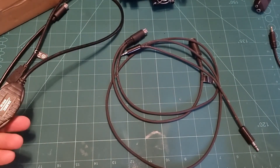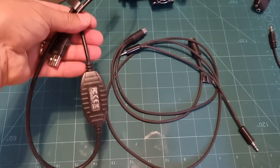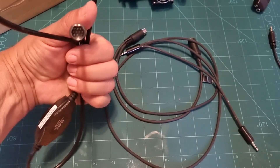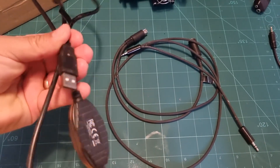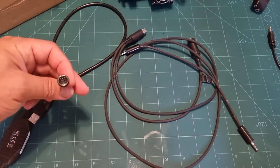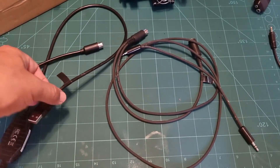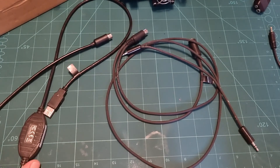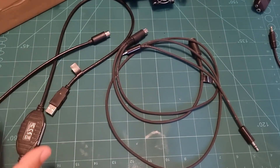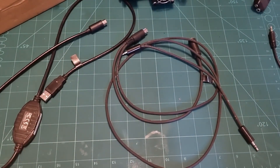I'm going to show you the difference between an SCU 20 cable, which has a 10-pin plug at one end and a USB at the other. The 10-pin plug goes into the back of your FTM 100, 300, or 400, and the USB goes into your computer. That works well in digital mode and gets you into the WIRES-X PDN system. You can then get the SCU 40 kit - they've changed the number to SCU 58 because of problems with Windows 11.